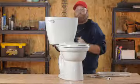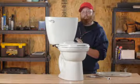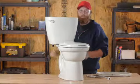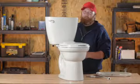You want to work your way back and forth between the two, that way you don't end up with a crooked tank where one side is going to wear out a little bit faster. You also want to make sure you don't over-tighten it because that can actually crack your porcelain.